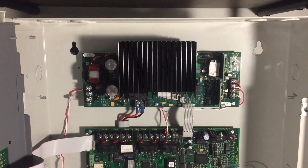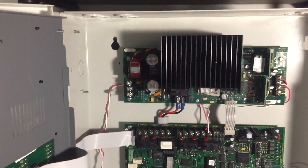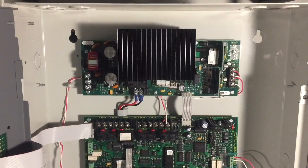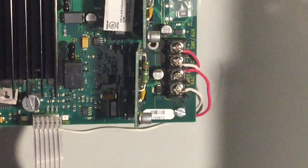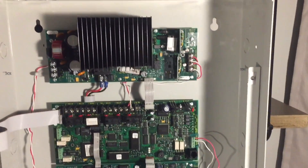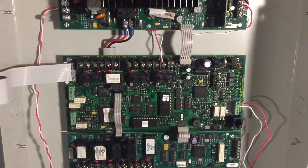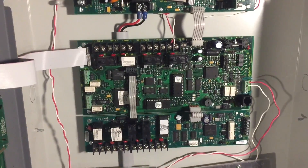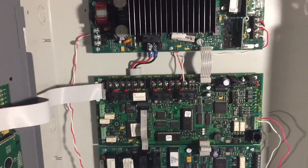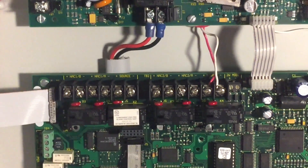Now that that's undone, it opens like another door and here's the inside of everything. This pretty big circuit board is the power supply — it takes 120 volts AC and steps it down to 24 volts DC. It's also a NAC power supply and a power supply for any monitor modules that control two-wire conventional smoke detectors. Moving down, right here is the main circuit board, which also has the NACs and the SLC. The main circuit board controls the whole system and has two NACs — NAC1 and NAC2 — which can be wired Class A or Class B.